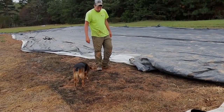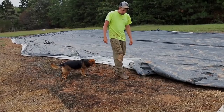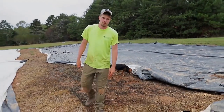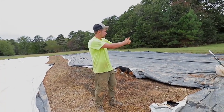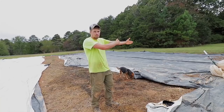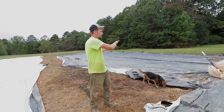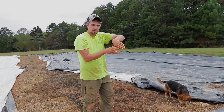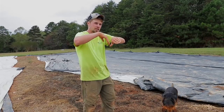It's pretty soft too. A lot of times bulls and stuff will get in here and break it up. After it gets to this point I'll bring the BCS with the rotary plow in, start in the middle, shoot the dirt this way and that way, then turn the BCS around, put the wheel in the ditch, and shoot the dirt back so it's about even. Then you keep doing that.